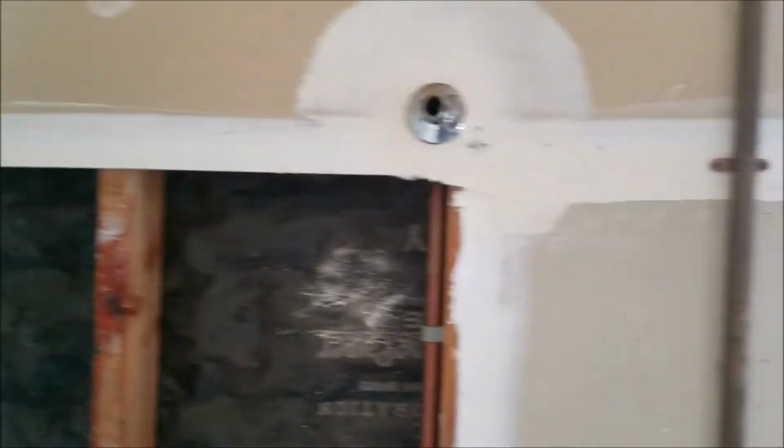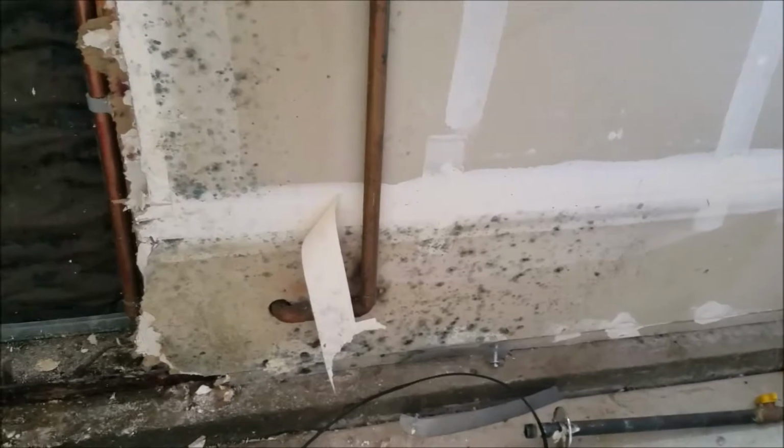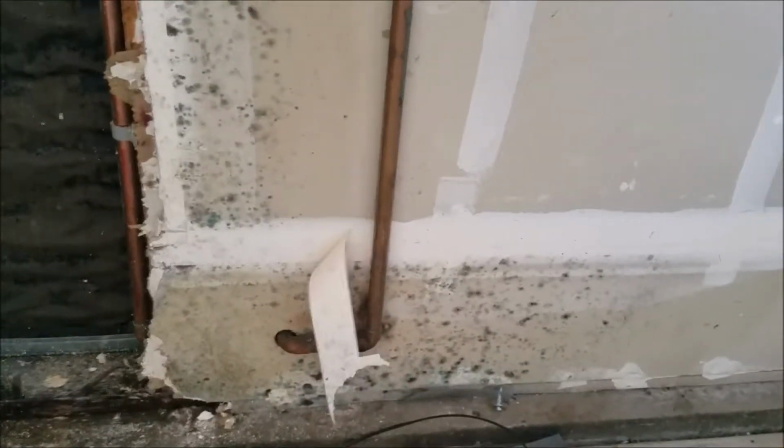We took it apart. This whole area had mold all over it, and we were thinking when we come out, we'd wipe it up, but we could see when we got here that it was fuzz all over. So we demoed back the sheetrock line. You can see that is a hard line, and then there's another line down there, 2-footer. So that was a 4-foot piece down to there. Another 4-foot piece here down to there, and then they got a little puppy, probably like a 12-inch piece down below. I think it's a 9-foot ceiling, that's why. So you got 4 foot, 4 foot, 1 foot down there.